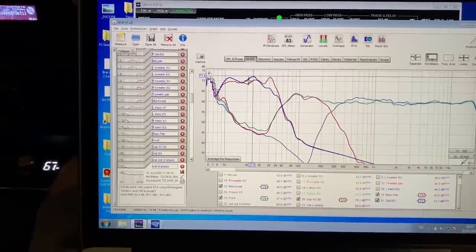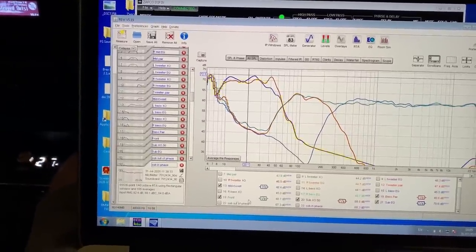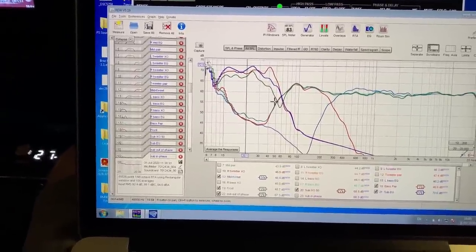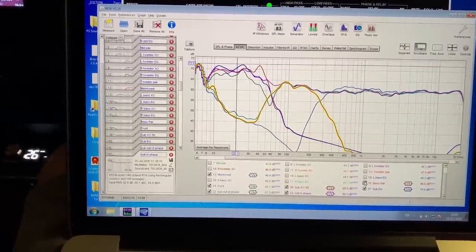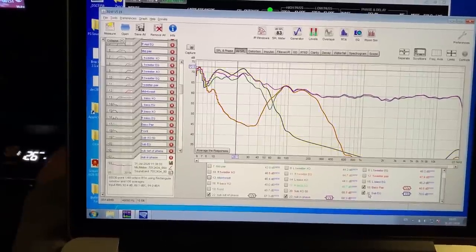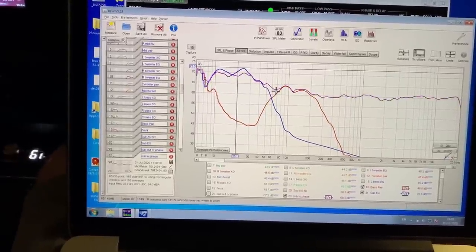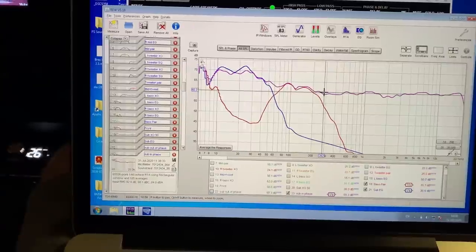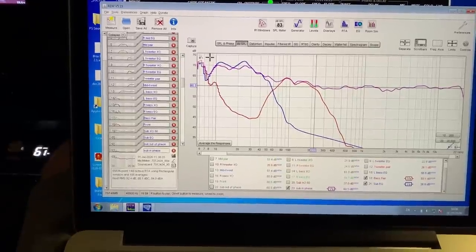The 25Hz range is pushed a bit more because we need extra low end to hear it linear. When the sub is not in phase with the mid-bass up front, you see a massive cancellation appear. When it is in phase — voilà. Taking everything else out, you can see the mid-bass pair summing pretty well. You adjust the sub level accordingly and then you have the ideal curve: keep it linear down to around 250-300Hz, then raise it 3dB per octave below that for the desired perceptual linearity.